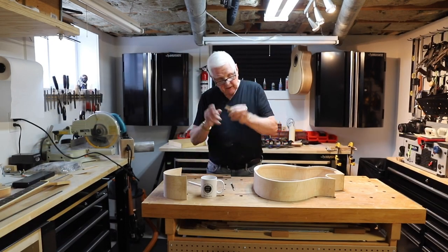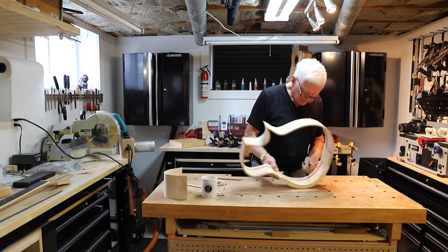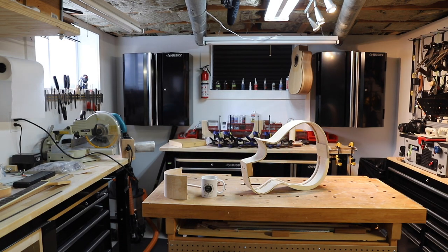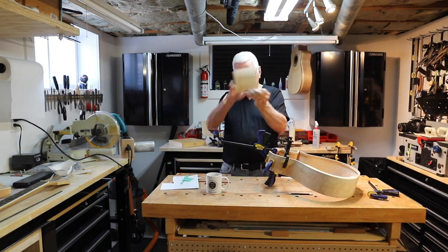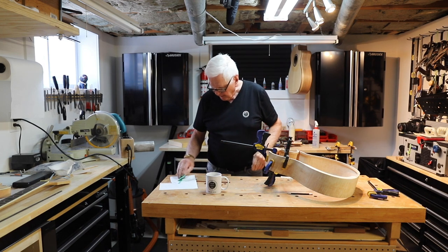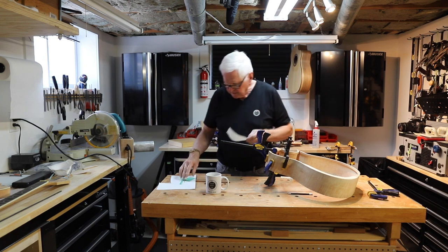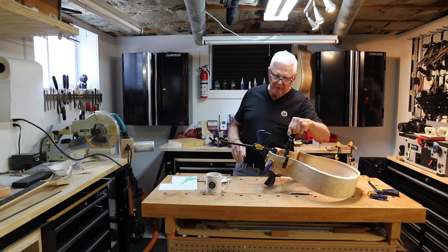It is a good idea to cut these slightly oversize. What I just finished doing here was cutting that round piece off — this is the cut-off piece. What I have done is made a piece of veneer and cut it based on this paper pattern that I ran around inside the guitar. I then took the scissors — which was pretty funny — and cut a shape. It's underneath; it's not glued in at this point.